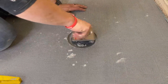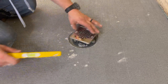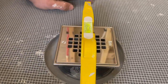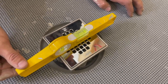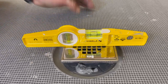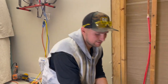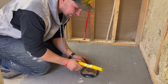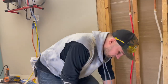It's important that you set this level. Get your level on here, put it right in the middle. It does have a little bit of play — the drain is designed for that exact purpose. This is very important because with large format tile, you want this thing to be level, otherwise there will be lippage on the tile at the drain and you'll see pooling — and we don't want that.